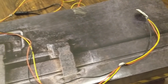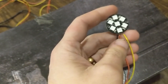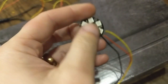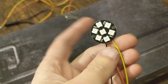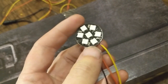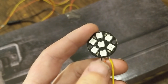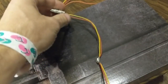I gave myself a little extra wire because that's better than having too little. I might end up changing the NeoPixel jewel out — this is the firing light for the acrylic tube, the light that comes on when you hit the fire button. It looks really awesome and is really bright, but the problem is that because of its size, it doesn't fit inside the barrel of the wand. A lot of people have talked about sanding down the sides, but I don't think I can do that without damaging the light. When I did this in the past, I used just another single NeoPixel — it wasn't quite as bright, but it worked alright.